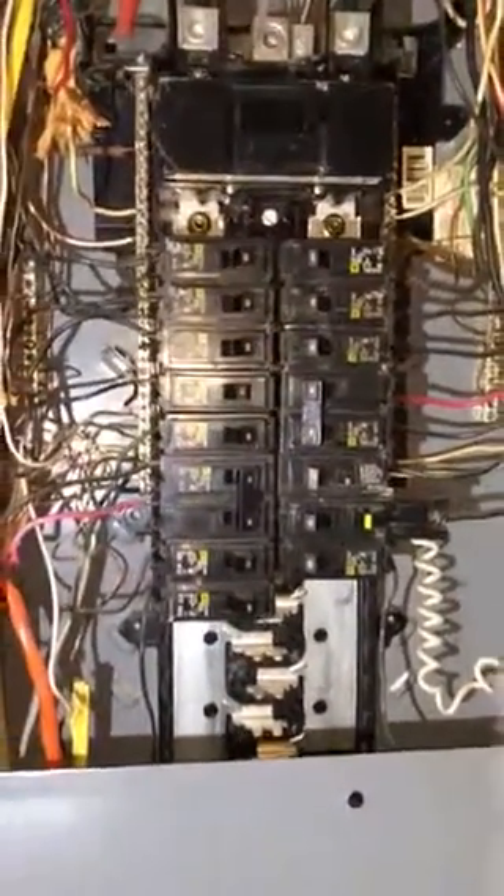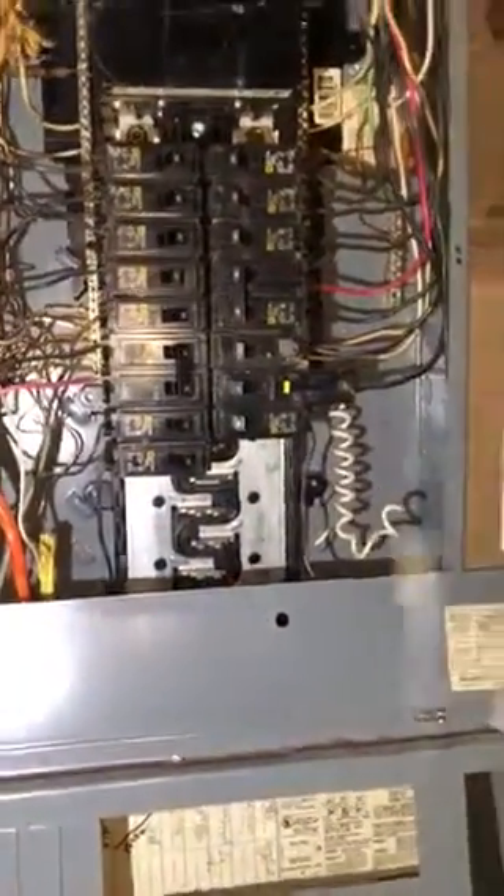The freon lines run up here and look like they go straight out the back. The air conditioner is right out the back right here. Here's her breaker panel — looks like she's got a 30 amp breaker on the AC, which is too big. You'll have to downsize that.